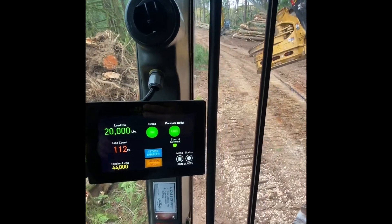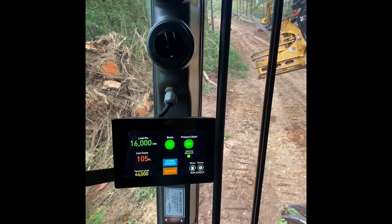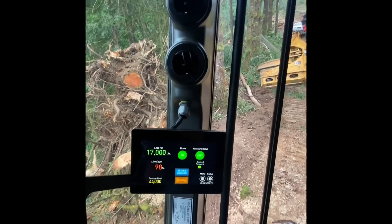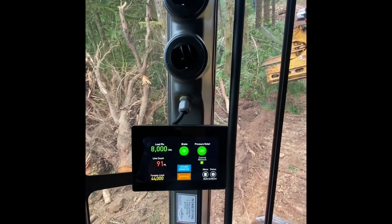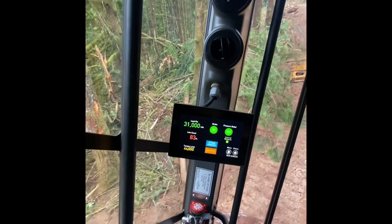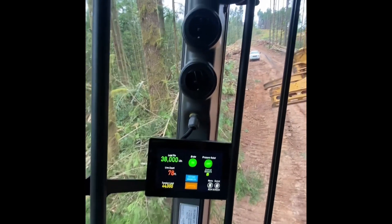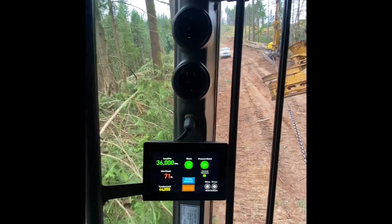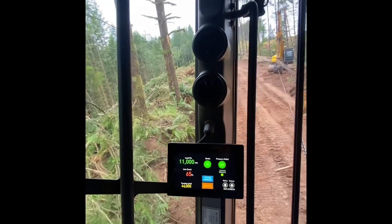Okay, I'm pushing forward on the pedals — it's turning, so put a little more pressure on her. But on the hill, pretty steep with good ground, you're maybe at 10,000 pounds on the line. That's traction assist — this thing's not going to pull you up a rock knob, it might, but that's not what it's designed for. It's traction assist — just helping you get up the hill. A lot of people get it confused.